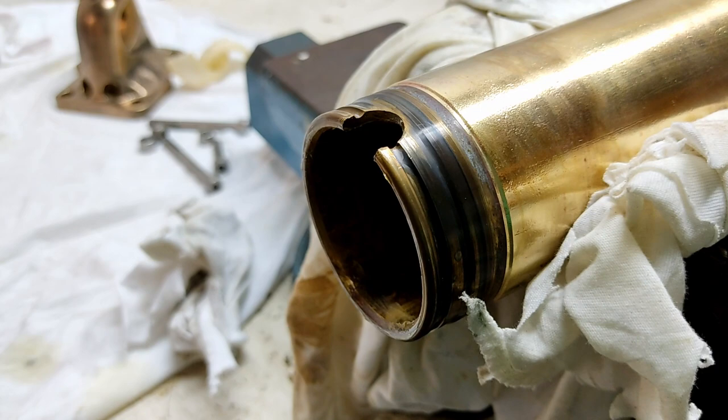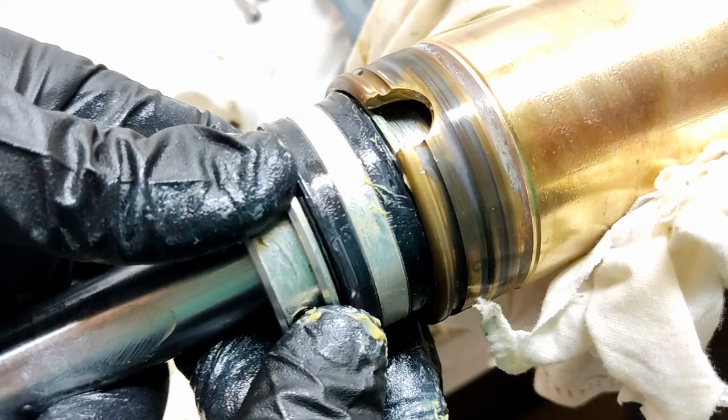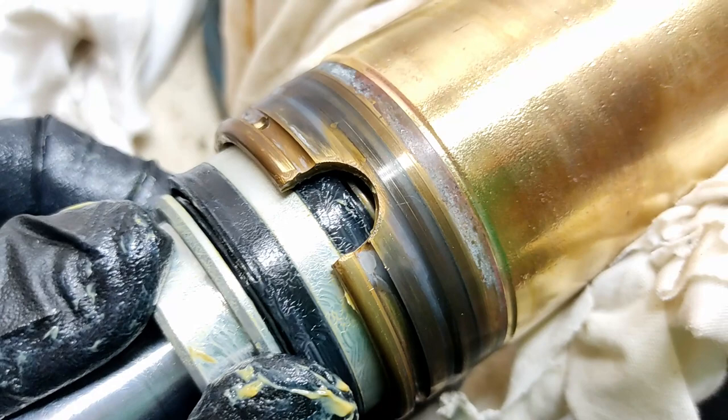And the lip seal that's at most risk is the first one going in, where the bucket is facing outwards as it's trying to go in. So what I do is I've lifted it up slightly so that the lip is actually engaged in the bottom before the top. And then I just rotate the lip seal in, and you can see it actually went in quite easily. But our lip is still sticking up here where the groove is. And I've got to very gently and carefully slide it past that, making sure it doesn't pick up.